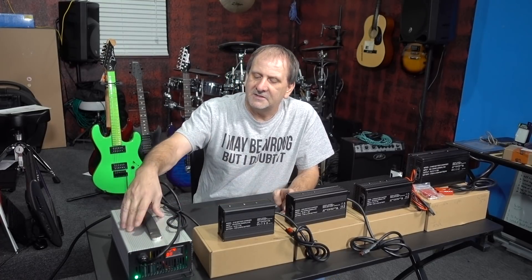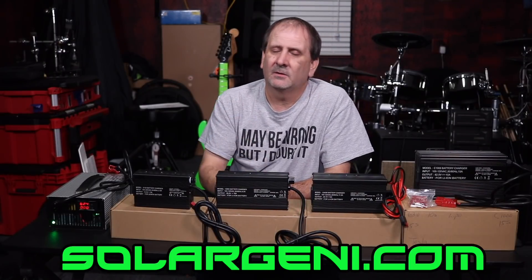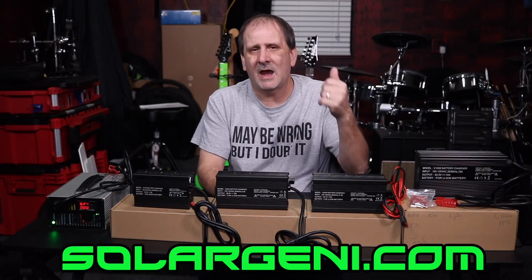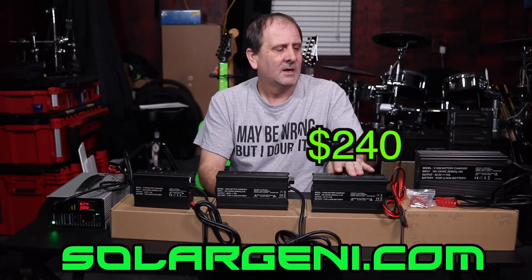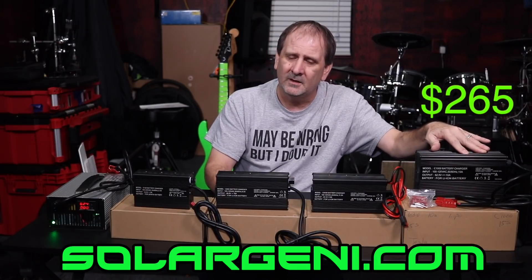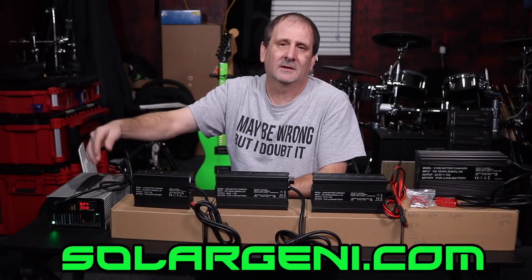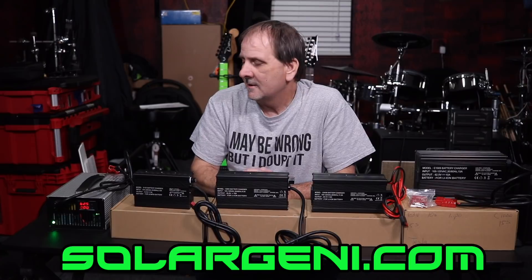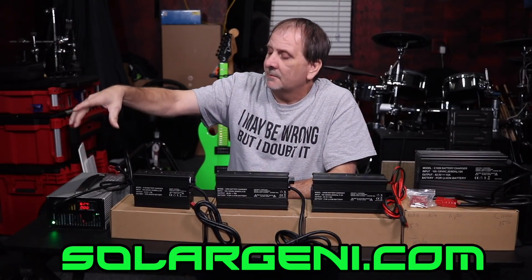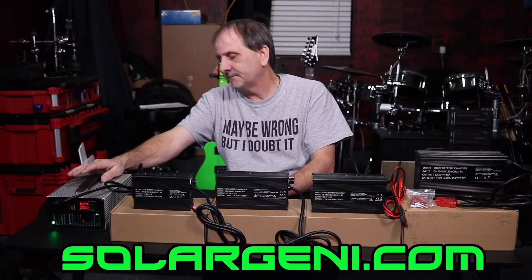Pricing-wise: the small 120-watt charger is about $60. The C600 runs around $100 to $180 depending on configuration. The C600B is close to or over $200. The C1000 is around $249. The S2500 is up in the $400 range. At its highest voltage range — 63 volts lithium 15s — you're getting 14 amps, which is expensive, but if you ran this at 12 volts you're looking at about 50 amps of charge power.